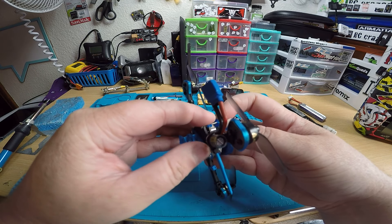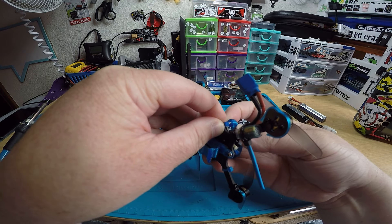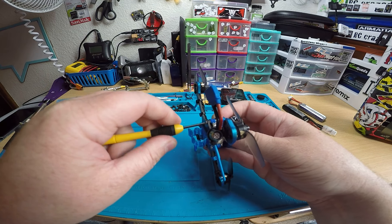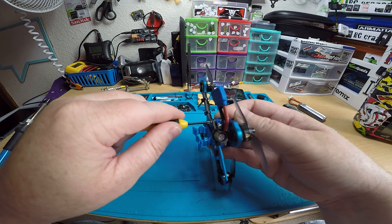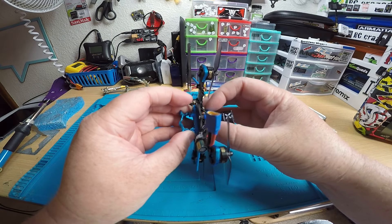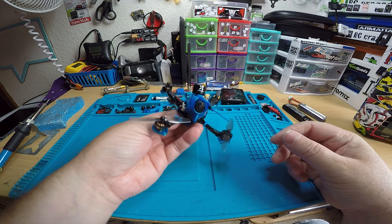After you bind it, push the screw back in, then push down a little bit on the canopy. Make sure it clears the USB — that's also how you plug in the USB. Squeeze on the sides to make it go over the USB as you're screwing it back down, squeeze in on the sides a little bit right here, and you're good to go.